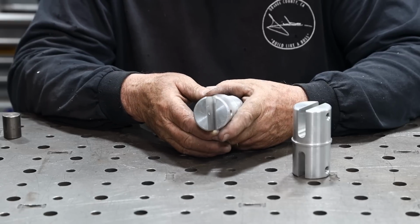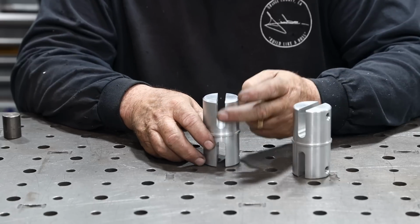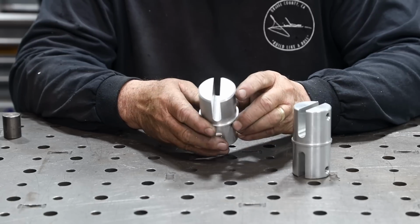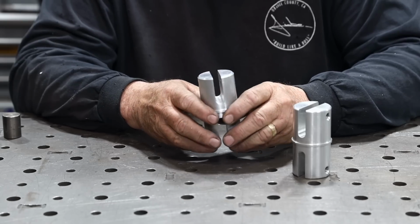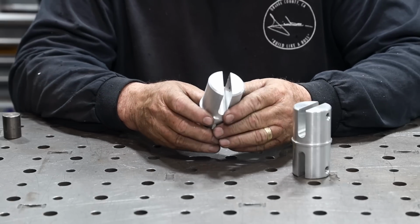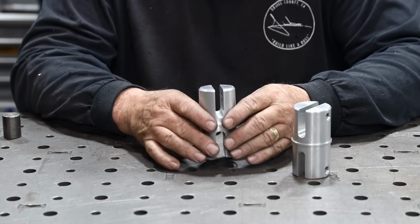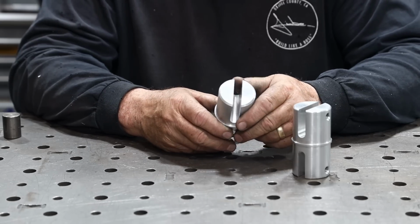I recognize that, and then on the next side I used the coolant, you can see right here, and it turned out absolutely perfect. It worked really good, and that is definitely a way to go. A nice clean cut. That coolant made a huge difference, so that's something that I learned when we're cutting aluminum like this, or a big piece of metal like this. It's important. I noticed that aluminum gets hot really fast, so it's important to keep it cool. And that mini cool with the cool mist worked really, really good second time around.